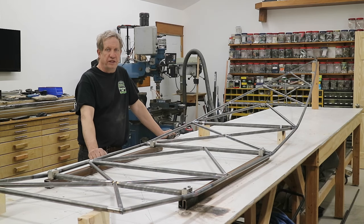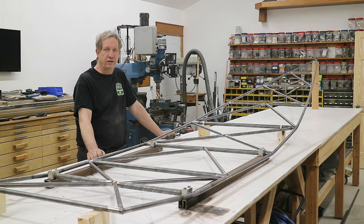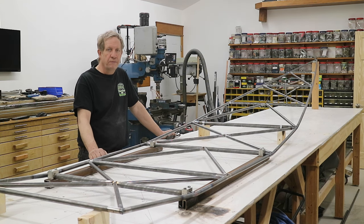So I'm pretty much finished with the fuselage bottom, with the bending now done, and that bending went really well. That was really easy compared to what I thought it would be. Once I started heating the joints, it probably took 5 minutes to bend each section. Now, there's some preparation for that, and that all made it a lot easier, but the actual bending was a smooth, controlled event with no hiccups or issues at all. So anyhow, with this done, I will move on to mating the top and the bottom together.